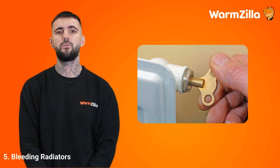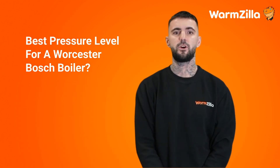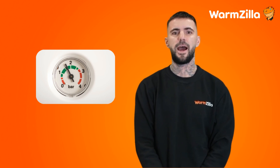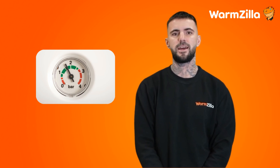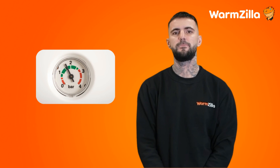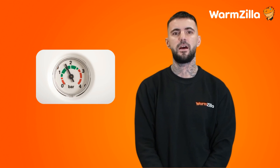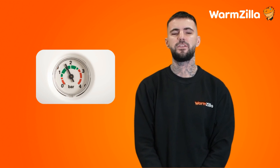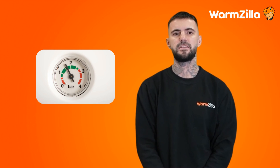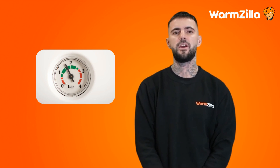What is the best pressure level for a Worcester Bosch boiler? All boilers need to maintain a stable pressure level to operate efficiently. The best pressure level for most boilers in the UK is between 1 and 1.5 bars, but always refer to your boiler's manual if your manufacturer's recommendation is higher or lower. Worcester Bosch boilers work best between 1 to 1.5 bars. Their system filling guide explains in detail how to read the pressure gauge, located on the front of the boiler: the needle in the green zone means efficient operation; in the red zone, the boiler will most likely shut down. Worcester Bosch also advises that if the system needs refilling very regularly, a plumber should be called to check for leaks in pipes or radiator valves.